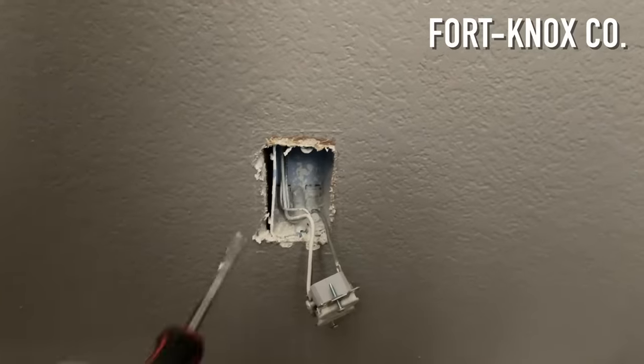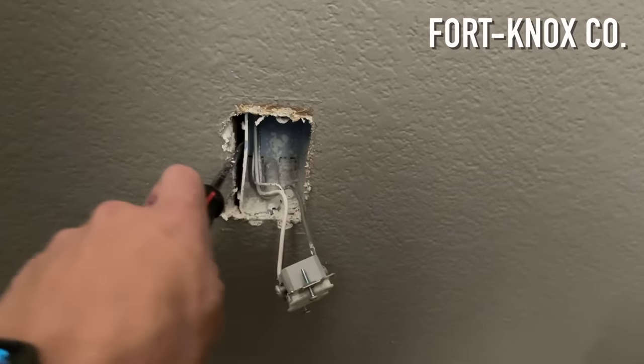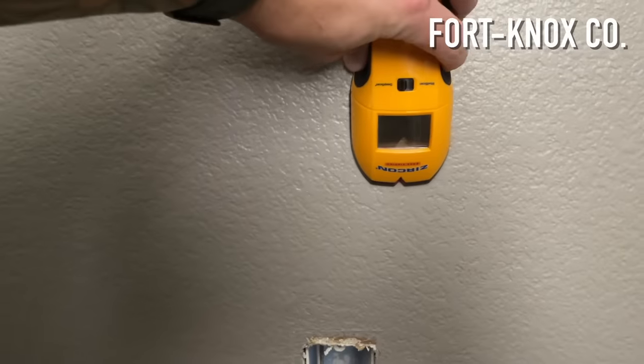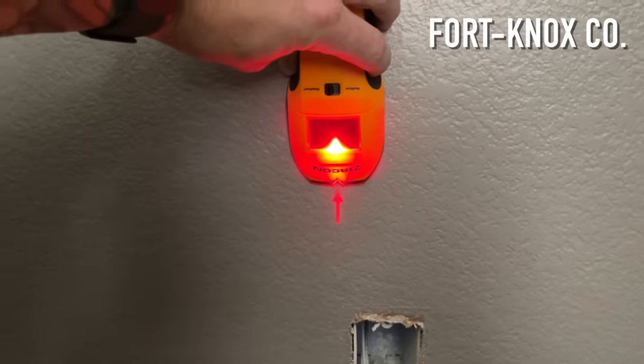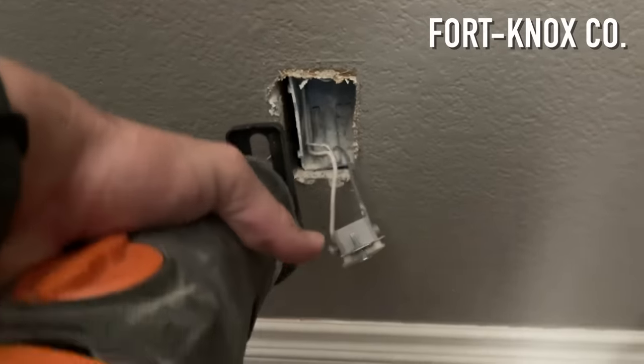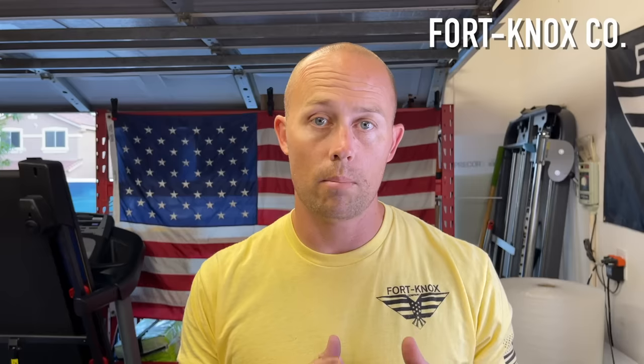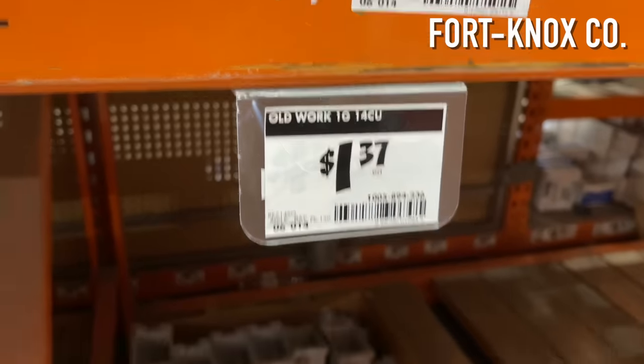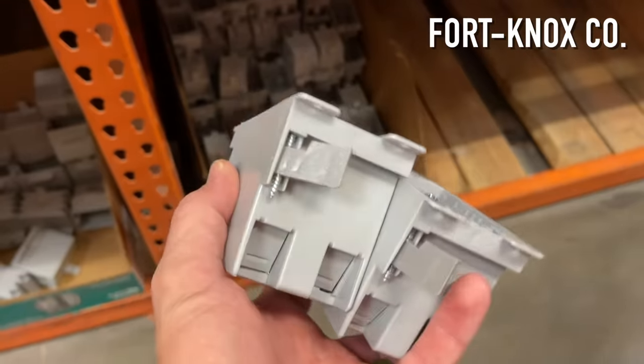Undo that outlet and take it out. You want to create a little bit of space between the outlet and whichever side the stud is on — that original outlet box is attached to a stud on one side or the other. Locate where that stud is, then take a flathead screwdriver and pry in between it a little bit to create space for your blade. Use your sawzall to cut the two nails holding the box in, then feed that box out and remove it. You'll be installing two retrofit boxes, which you can find at any box store — links are in the description below.